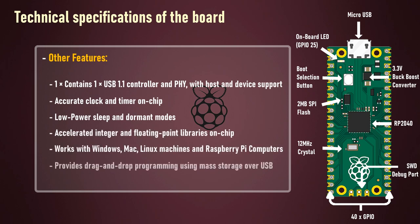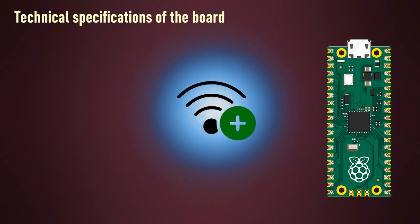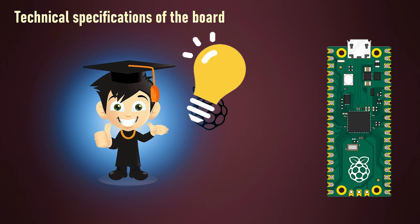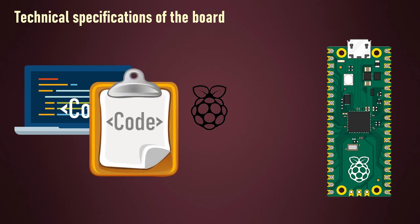The biggest disadvantage of Raspberry Pi Pico is that there is no Wi-Fi or Bluetooth on it. ESP32 and ESP8266, which you can buy for a similar price, come with Wi-Fi and Bluetooth. You can add wireless connectivity via external components, however that would require a little more knowledge and experience to get it working. Since Pico is not a computer, we need to write our code on a different machine using an external application and then flash the code on the microcontroller over USB.